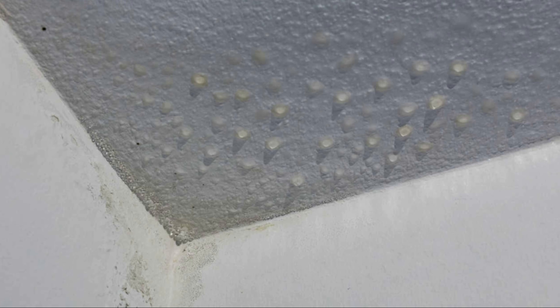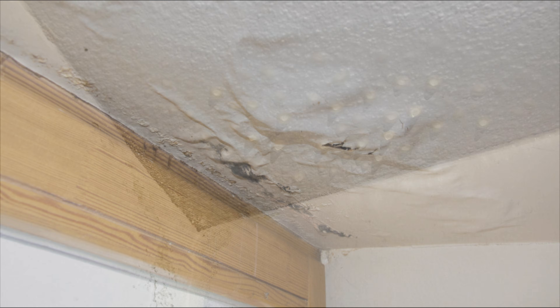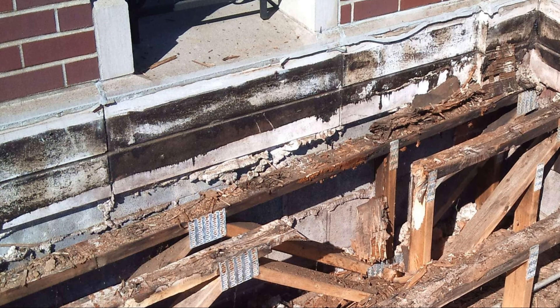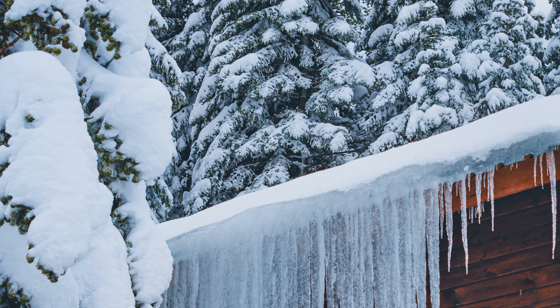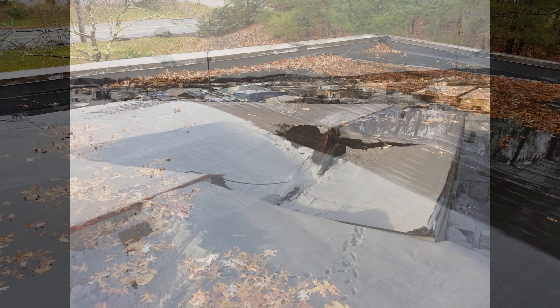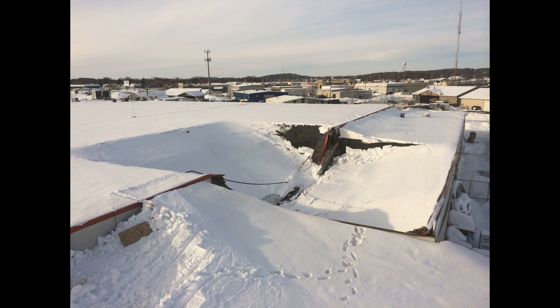Condensation in a flat roof assembly is a common problem in cooler climates that can cause a lot of moisture and mold problems over the course of a heating season, and eventually the rotting of the roof structure if the problem is not addressed. This is a big deal especially if the roof is being loaded with a lot of snow and ice each winter, as the weakened wet framing can result in sagging which supports ponding water and even structural failure if it's really bad.